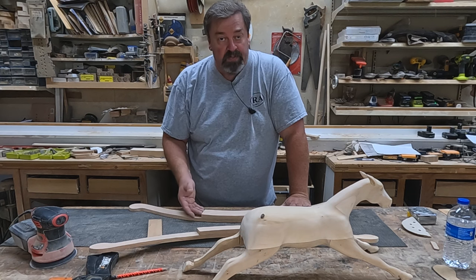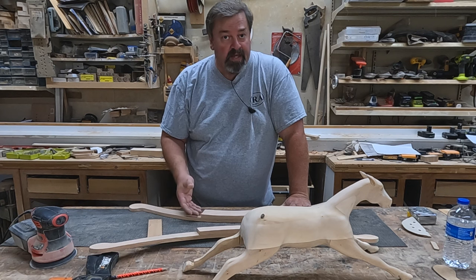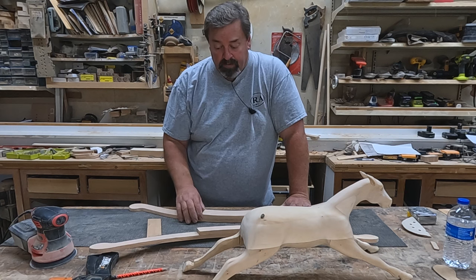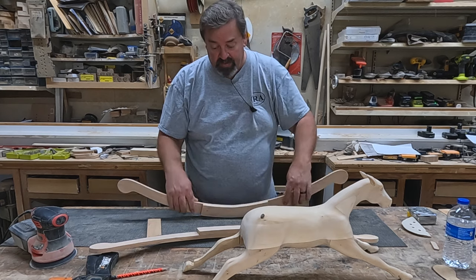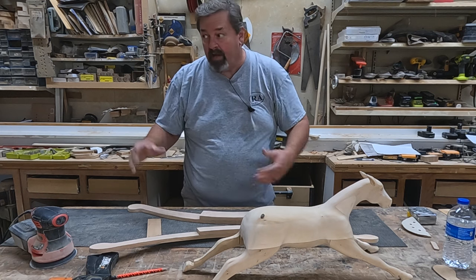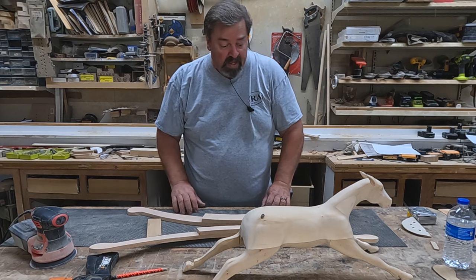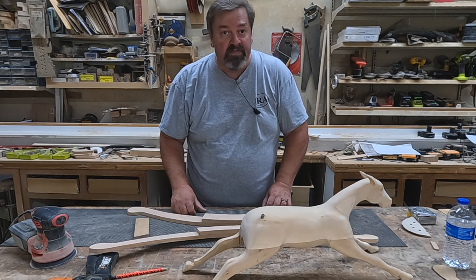We'll nail those. We'll just use the brad nailer again. Normally on a small medium bow rocker, I'll put screws in there and then put a cap, a cherry cap or something over top of that to fill the hole when I recess it. For this, we're just going to put a little bit of glue, and we'll use 1-inch brad nails again and shoot those nails in and fasten this together. Then we can move on, make the slats, and glue up some material for the turning. I may even have something thick enough that we can turn the two little turnings for the ends of these. So that's where we are at, and let's get these little rockers finished up.